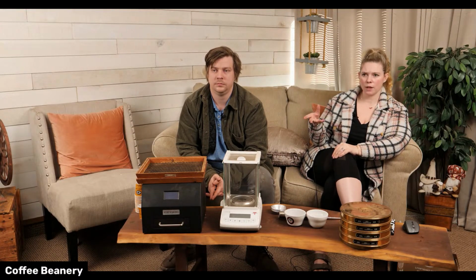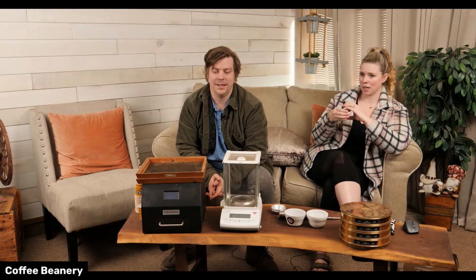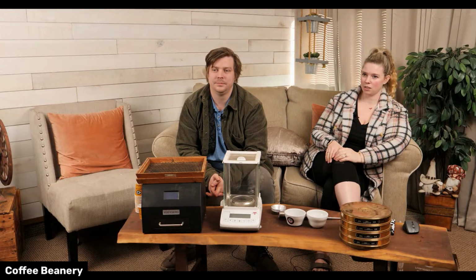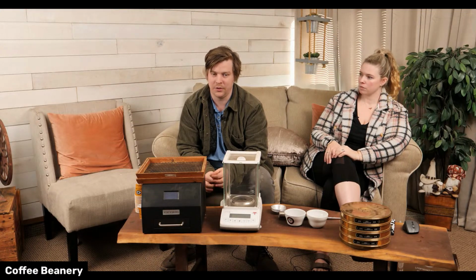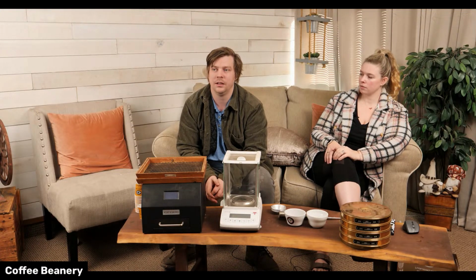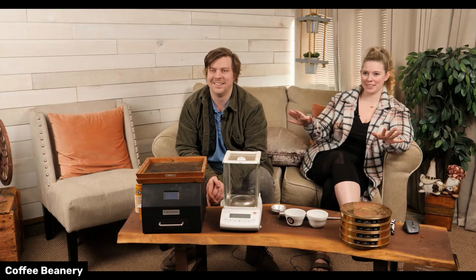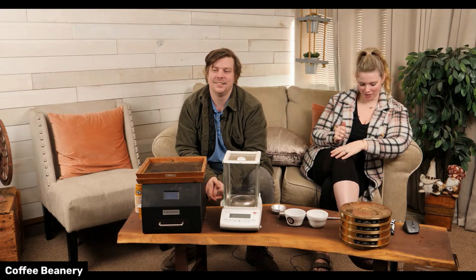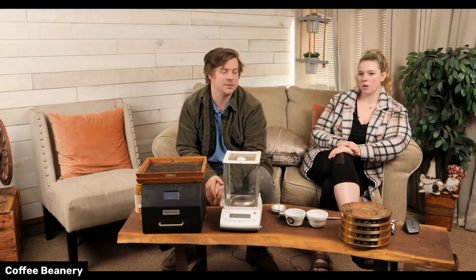Our K-Cup machine also has some cool quality control features. What does it do? It squeezes or presses on them, and if it's not sealed, it kicks it out of the machine. Yep. If it squeezes it and the top of the lid doesn't pop up a certain amount, then it'll just reject it. Some of those rejections can be a little bit messy, especially if the lid wasn't sealed on. It just opens and goes all over the place. Kim's always cleaning out the bottom of that machine. But hopefully I haven't heard as many issues since we started using the new one.